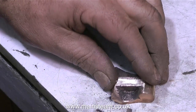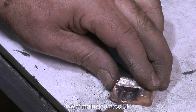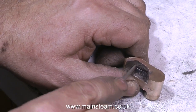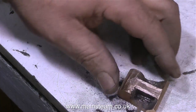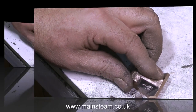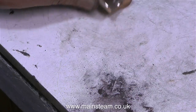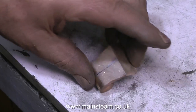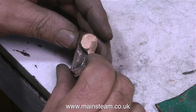I don't want this to look like it's been CNC machined. I want it to look like a human being has put some effort into cleaning it up with a file and sandpaper and little machine tools. The small machine tool I'm about to use is my Minicraft drill, fitted with a drum sander, which just about gets into the recesses. It would be possible, using things like dental burrs and small drum sanders and little grinders, to get the finish on the inner surface just as shiny as the finish on the outside surfaces — but then it wouldn't look like a casting.